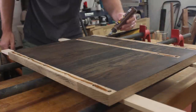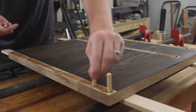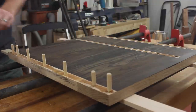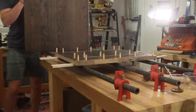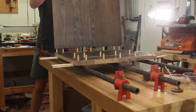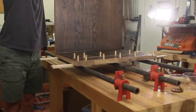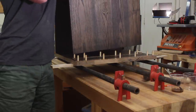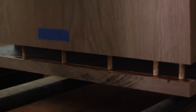And finally, it was time for the dreaded glue-up. I don't usually stress about glue-ups, but I had a similar design go haywire earlier this year because the dowels I used were way too tight. So this time around, I made sure each and every dowel fit into its hole nicely. After doing that, I was left with 30 or so dowels that were too tight. After measuring them with calipers, they were only 5/1000ths or so of an inch bigger than I needed, but it really makes a difference, and the glue-up in this case went much smoother than the other one.